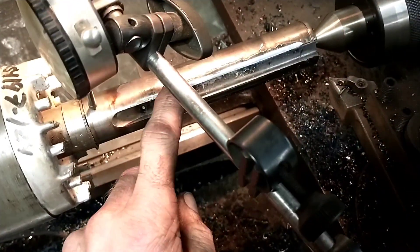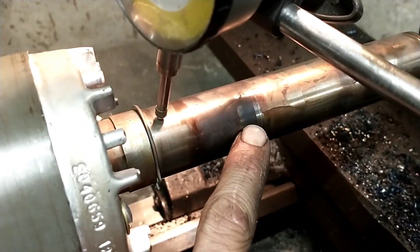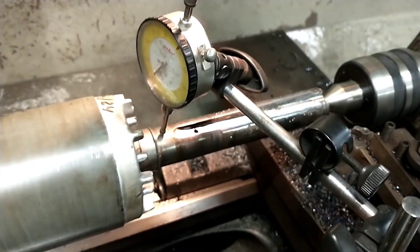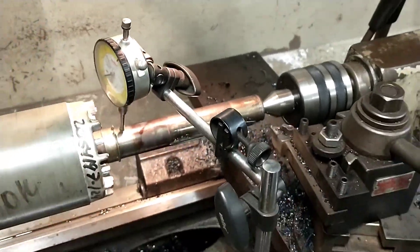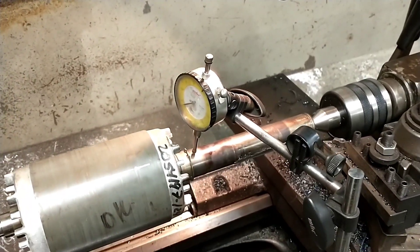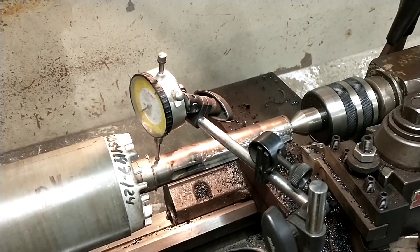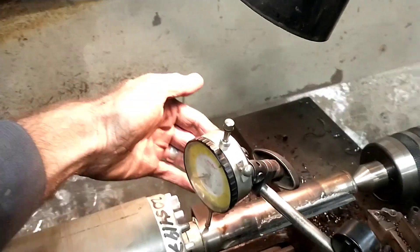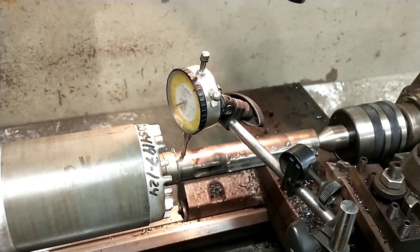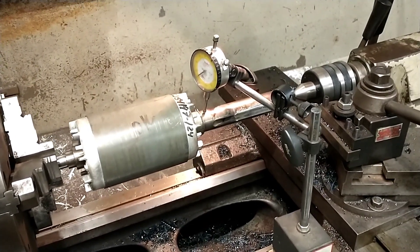So what I think I'm going to do is cut down again. Before, I cut until I just touched the backside and then I stopped — right there you can see I just touched it. The step at the edge of my weld is how much it was deflecting before, and that's quite a bit worse than what I've got now. The more material I remove, the weaker the weld basically is and the more it wants to go back to where it used to be. Then I'm going to take this thing out, set it on some hardwood blocks, and try taking a three-pounder and a hardwood block on the backside — just beat on it a little and see if it'll move at all. If that doesn't work, I'll resort to putting it in the press.